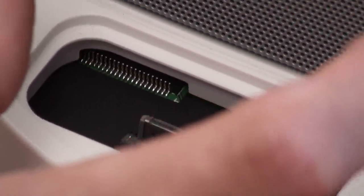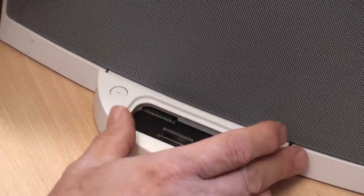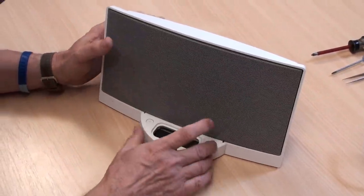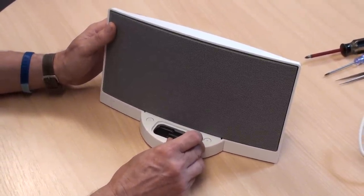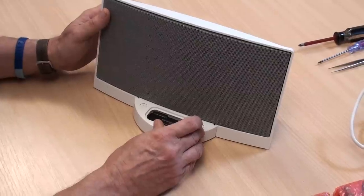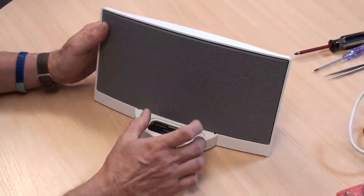When I say 'charging your iPod' — if you put an iPhone in a Type A dock, an iPhone will not charge on a Type A dock. You need to check it with one of the older iPods. On the website in the technical guide section there is a charge mode chart showing which devices charge on a plain Type A dock. The Type A dock supports firewire charging — F-I-R-E-W-I-R-E — so make sure you're using the correct Apple device on your dock to confirm you have connection and power.